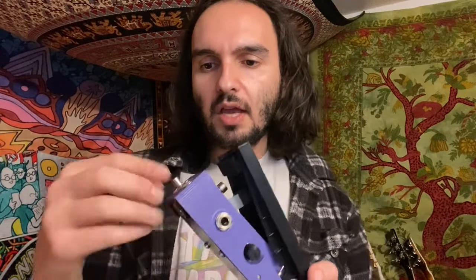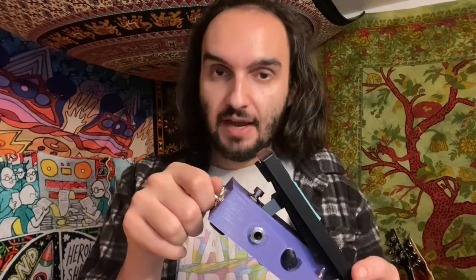So it feels amazing. It's also got a volume control. Yes, it doesn't have a knob. It is not supposed to have a knob. This is just the potentiometer. I think if it had a knob on it, it would probably get knocked around too much and your settings would change, especially with it being so close to the output jack here as well. But by having the volume control maximum, it's like the full boost that you get from the original grey WH10. You can reduce it to closer to the sound of the black WH10, which used a different circuit and had less volume boost.